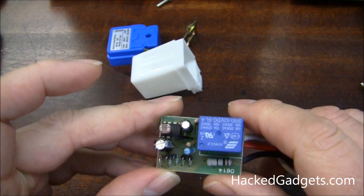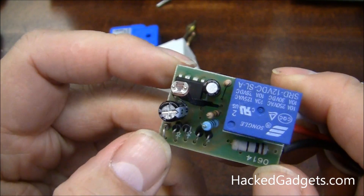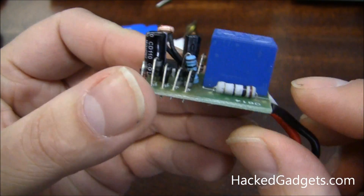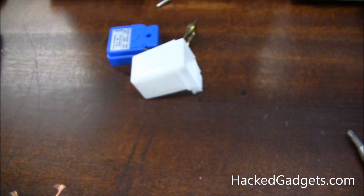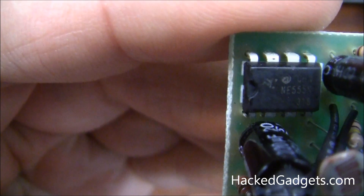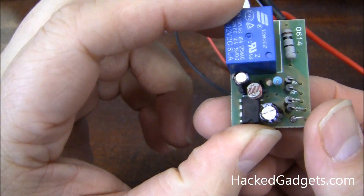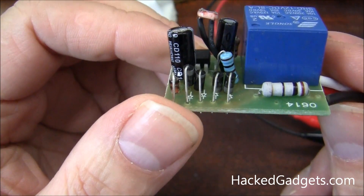Okay, so here's the actual circuit. There is a bunch of passive devices and there is a component — could it be that simple? We have a photo cell here, a couple caps, a bunch of diodes down there, a large resistor. And probably an op amp there, I'm thinking. Let's get in there close and see what that actually is. I was absolutely wrong — that's actually a 555 timer. That's pretty cool. I had a quick look at the circuit and it seems quite interesting. It's built as cheap as you possibly could, and using that 555 timer is quite good actually.